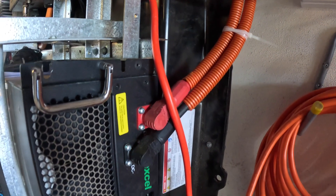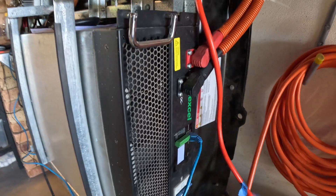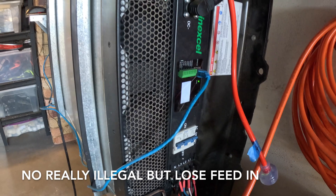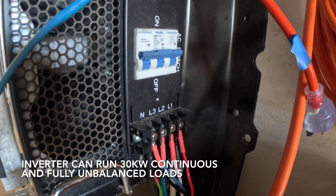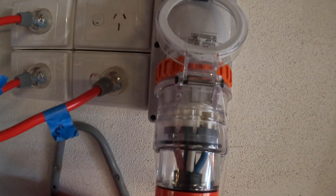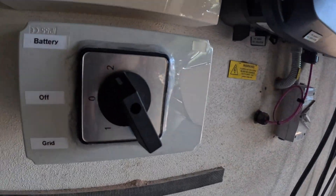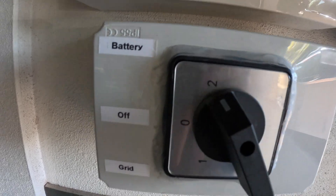I've got space for another charger, giving me 12-point-something kilowatts of charging. The high voltage DC also goes to my 30 kilowatt three-phase off-grid inverter — it's actually bi-directional, but in Australia we're not allowed more than five kilowatts of inverter connected to the grid for residential properties. So this thing is illegal to connect to the grid. Essentially what I've done is run the entire house off-grid — 30 kilowatts of AC coming out here across three phases, fed into here. I could unplug this and plug in a standard three-phase generator, and that power goes all the way to this interchange box.